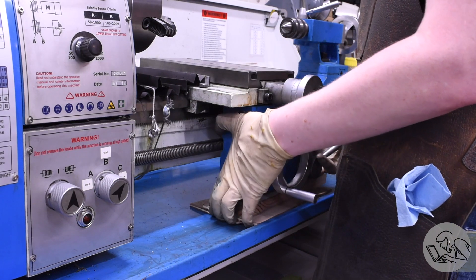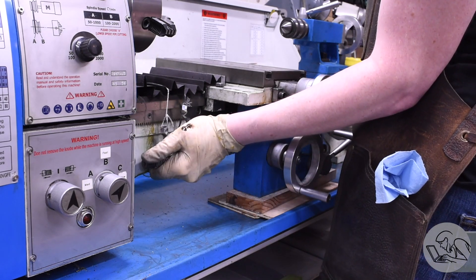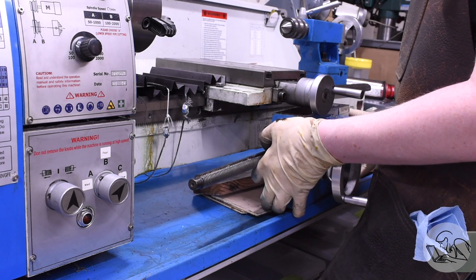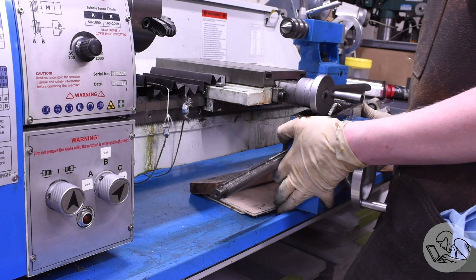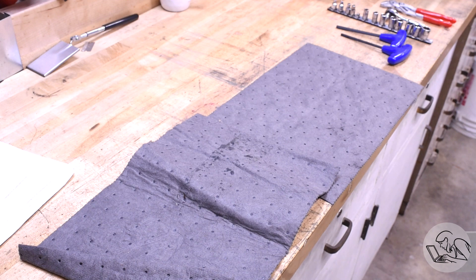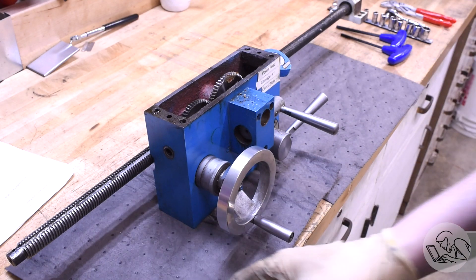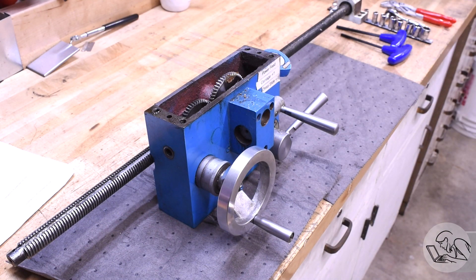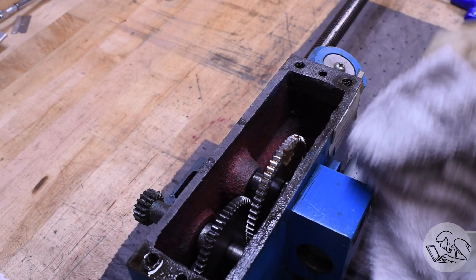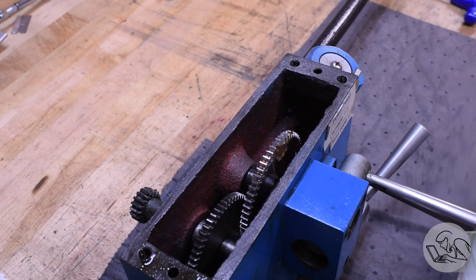It's good to always have a big stock of imperial and metric hardware on hand — the threads in these taper pins happen to be M4 by 0.7. Out it comes, and that taper pin is covered in crud. Get the other one out, and now let's fish this carriage out of here. The lead screw slid on its own actually — I didn't have to do it in quite that order — but out came the lead screw and now I can fish the entire assembly out. Just got to get under the cross slide hand wheel, and there we go — result. Onto the bench. That stuff I'm setting it on is called pig mat — it comes in three flavors absorbing oil and not water, water and not oil, or both. It's great stuff for oily projects like this.